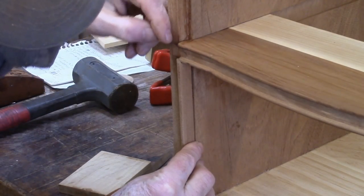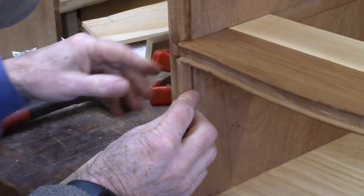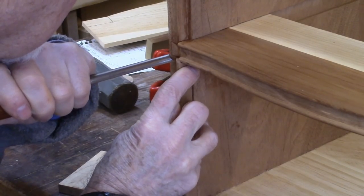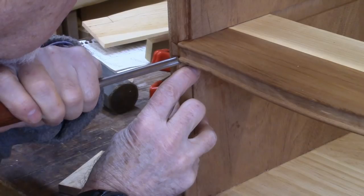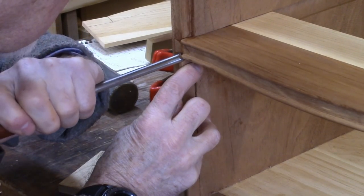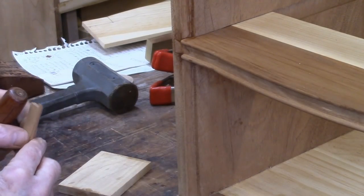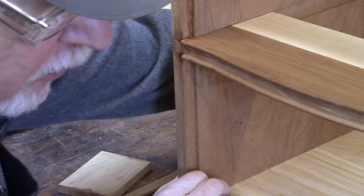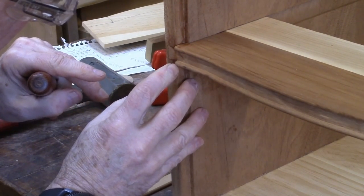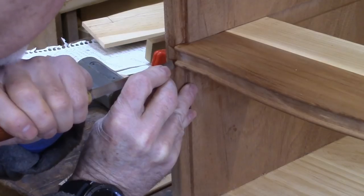As you can see, the little stub is up there and it matches up pretty well. Then I just use a chisel here as a marking knife to mark off where the miter needs to be. There's a very small corner right there that needs to be taken off, and you can pare that off.